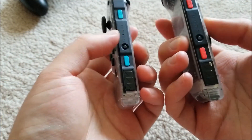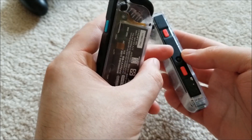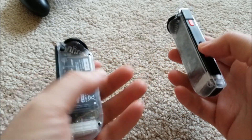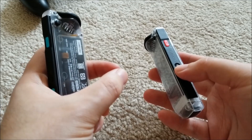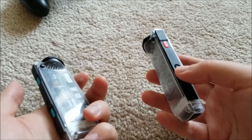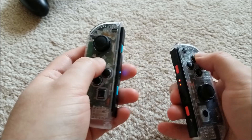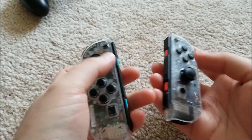One thing to be upfront about: there is a bit of an issue when you actually go to remove the LEDs — desoldering them. Chances are the LEDs themselves won't survive. All the materials of the LEDs are sort of like a gel or epoxy on the front of the LED, and when you heat it up long enough to remove it, it tends to break away from the backing material and pretty much kills the LED. So I pretty much destructively remove them. That's a limitation you have to accept — order extra LEDs in case you need to desolder them or you get them the wrong way around, because you're pretty much going to destroy them.